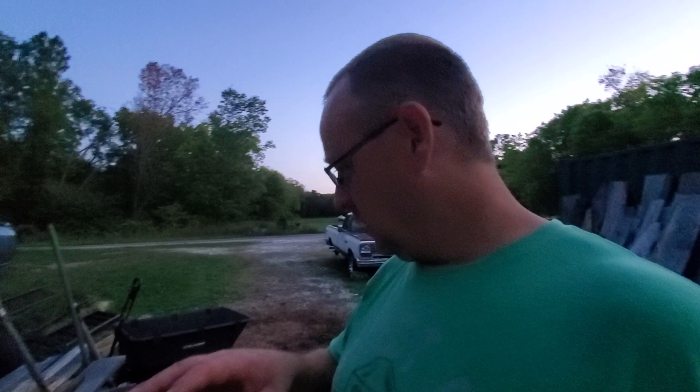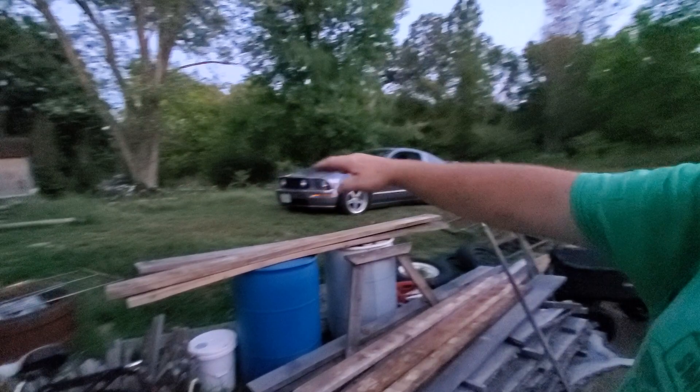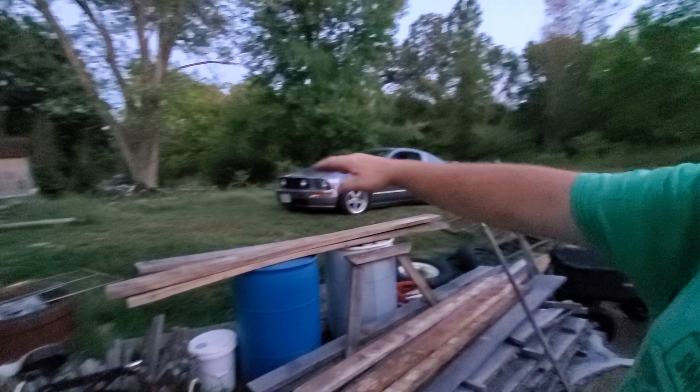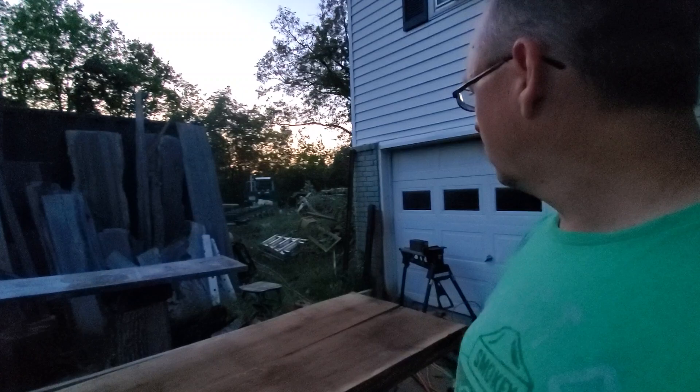What I really would like to do is actually dig out part of this hillside right here and put a retaining wall in with a French drain, and just have the block wall — your stem wall, your block wall — and then build on top of that and have it actually come out even with the side of the house right there, which would actually require pouring more cement over there. The slab would actually have to go over about two feet further that way, so there's room for me to dig that out and pour a stem wall and do all that. But that's a future project. Anyway, we'll see you tomorrow guys. Thanks for watching. Bye.